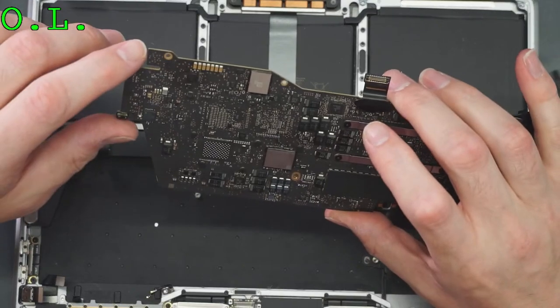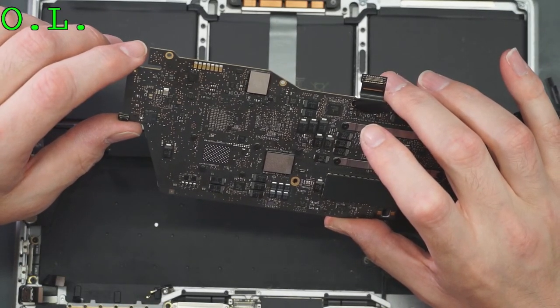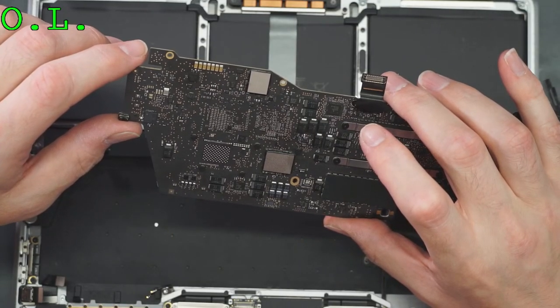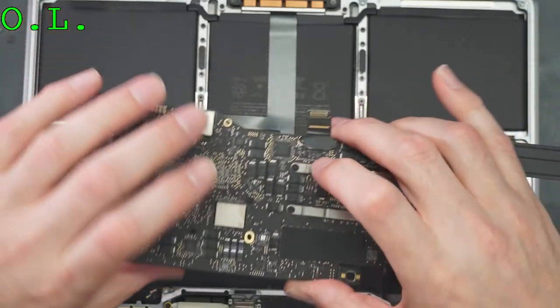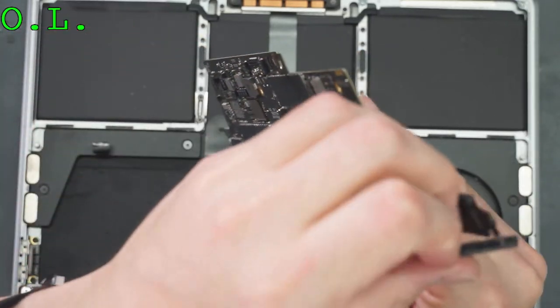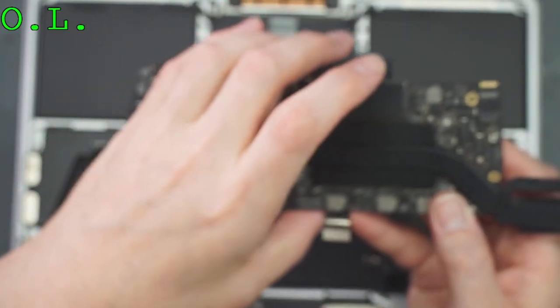You broke a SATA connector on a hard drive. Should I try to fix it or send it to Paul? If you have a hot air station and you're somewhat okay with soldering, it's not that bad to fix it yourself. You're not gonna fix the SATA connector. Forget that. You're not gonna put a new SATA connector on.